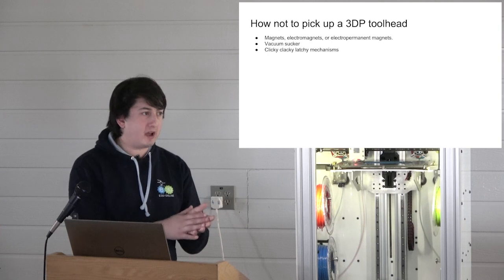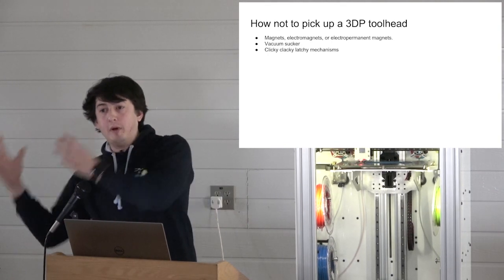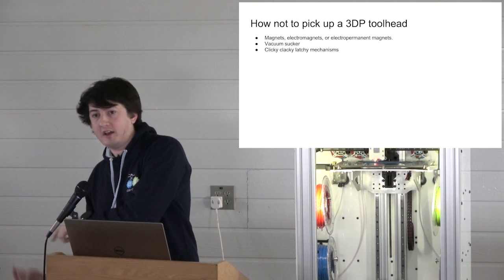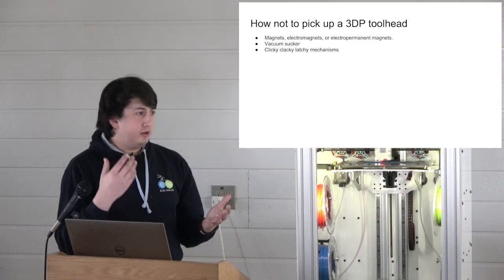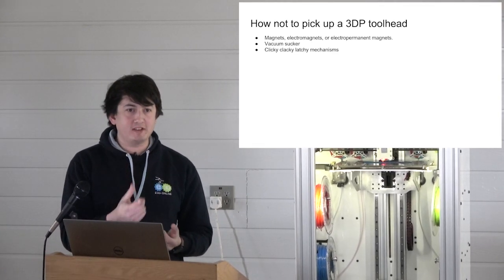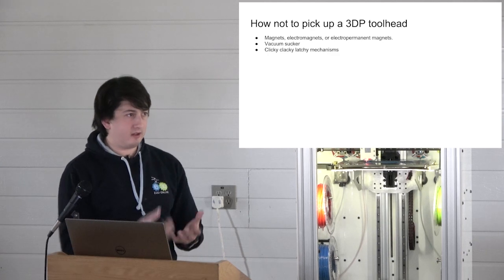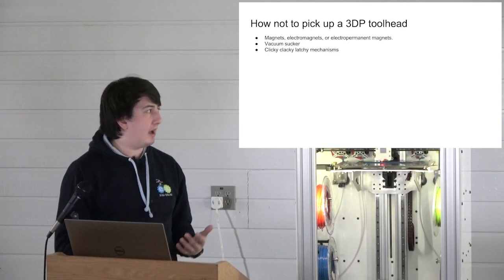It's also super lightweight because it's like the Bowden system of doing it: the vacuum pump is off to the side and you just run the hoses up there. And if you have that small area, even with an El Cheapo Chinese Alibaba pump, you get like, I don't know, 10 kilos separation force. It's good.